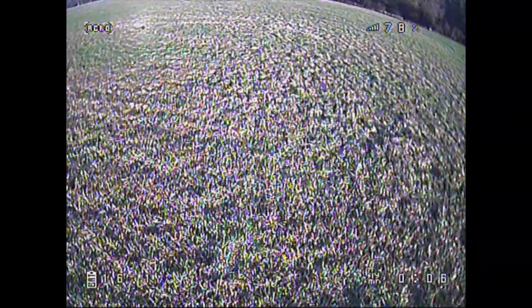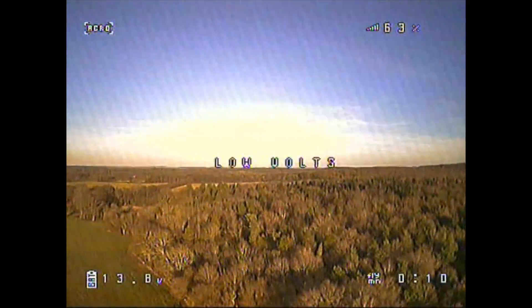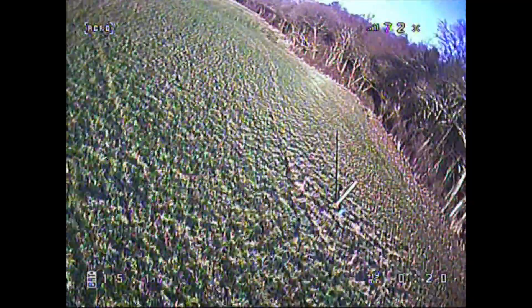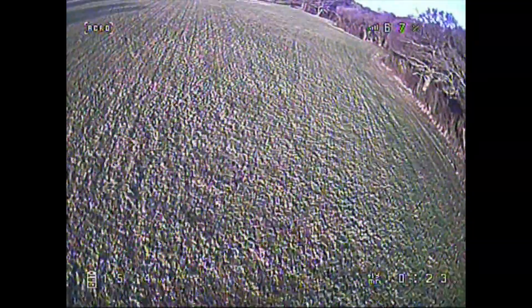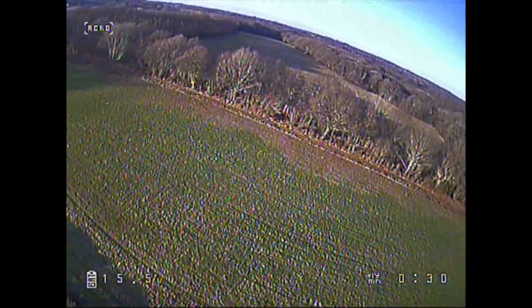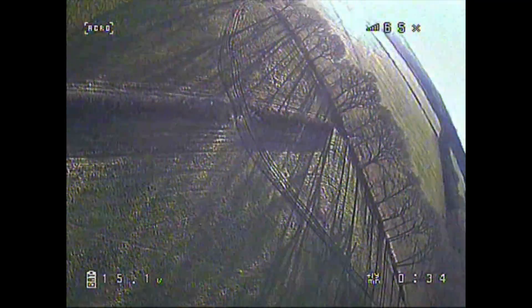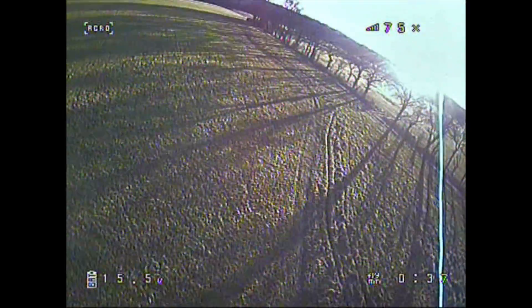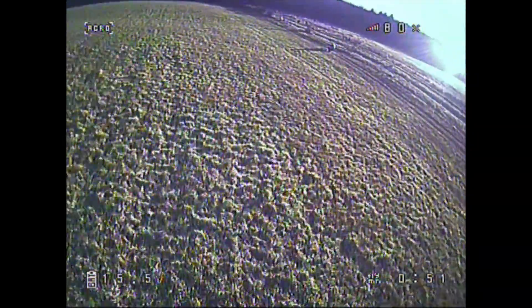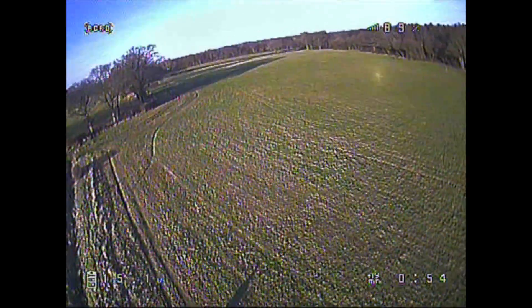So this is just on a regular flight and it's going to be pretty quick. Every time I really try and put the throttle on, two things happen: one is the LiPo just sags to nothing, and the other is the camera angle wasn't up enough so I can't really get any speed. But it seemed to cover the ground fairly quickly. As you can see, I'm not happy at all with the shakiness this flight controller has given me. I wanted to double check it was the camera mounting but I forgot to put the SD card in the Firefly so I didn't get that recording. This is shifting about way too much - it's not natural at all. I did some tuning on it and I couldn't get it to shift. Pretty much carried on as before - definite swap out needed.